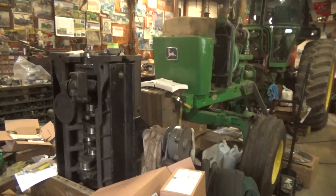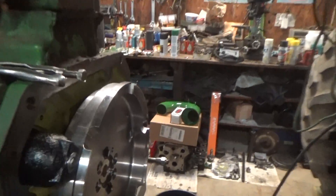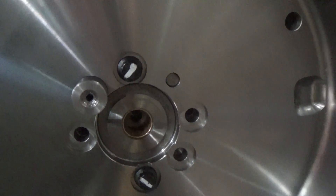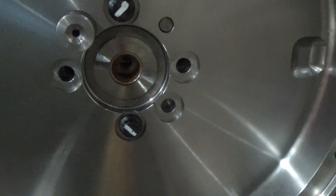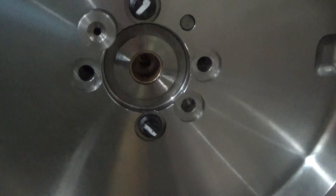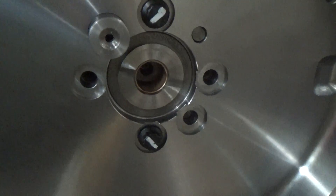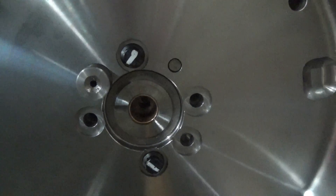We got to put a steel flywheel on this tractor — one of our customers. On a stock John Deere it just has four holes, four bolts that hold the flywheel on. John Deere stock ones — like on a 4020, 4430 and stuff like that — they have four bolts. Some of these higher horsepower applications, we like to put a little bit more bolts in them, so sometimes we have to drill and tap the crankshaft flange to put other bolts in.